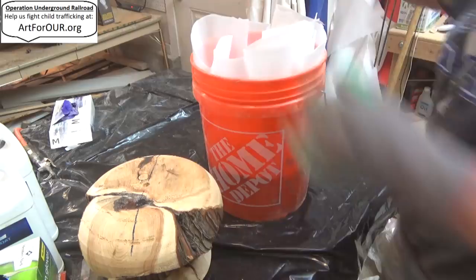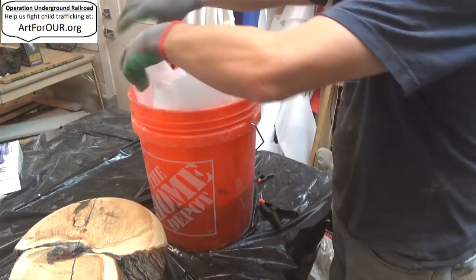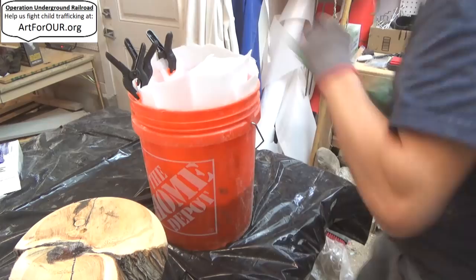I've been using clips because you do get these folds. Trying to wrap a sheet around a 3D object, you get all these different folds, and so I clip them to kind of minimize the resin escaping into the folds. Then I put sand around the outside, put the mold, or the item, in there, and kind of mold the sand around it